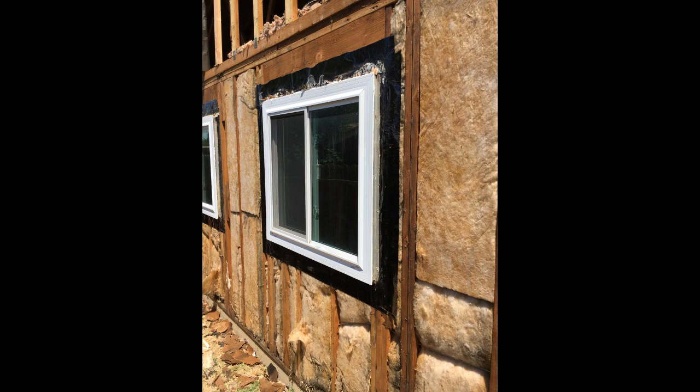You'll kind of see the siding, how it sticks to the caulking there. And here's the side view of the replacement fin over the top of the old existing aluminum frame window. And you'll see the caulking there. It keeps it in place, but it makes it very difficult to work on. Once those are sealed together and there's some dry rot present, they pretty much are stuck together.